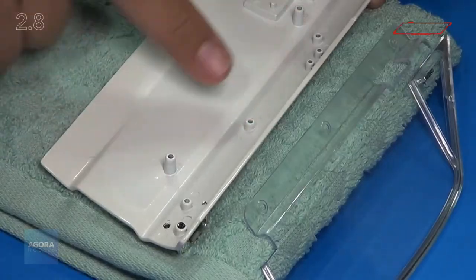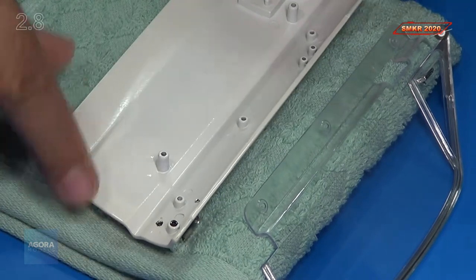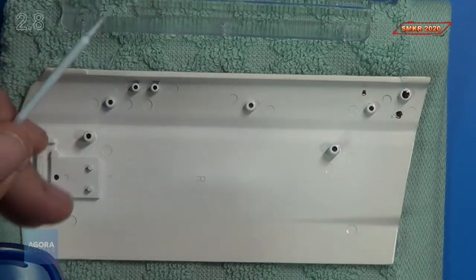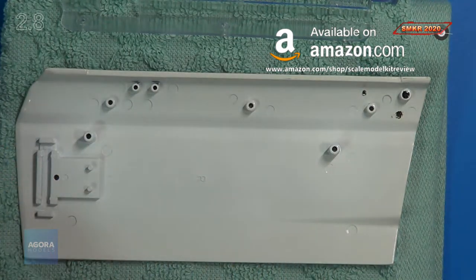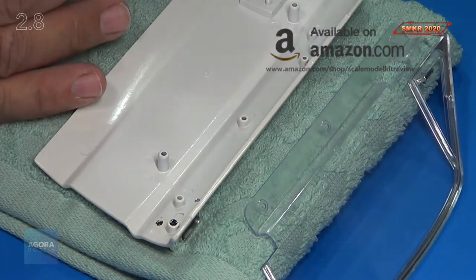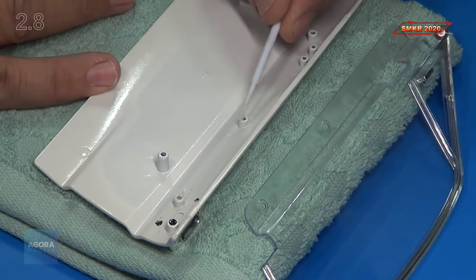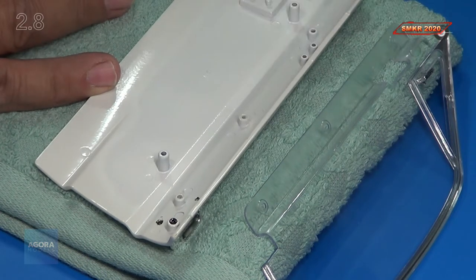To help with that, I'm going to use some Vaseline to lubricate the holes. It makes the screws go in a little bit better. These attachments aren't pre-cut — there are no threads in there. The screws actually have to generate their own thread. So to help that along, I'll lubricate it using this little applicator tip. You can find all this on my Amazon store. With the Vaseline, it doesn't smell like machine oil like some other items out there. I've been using chapstick also — same thing. It doesn't smell and it doesn't leave a mess.